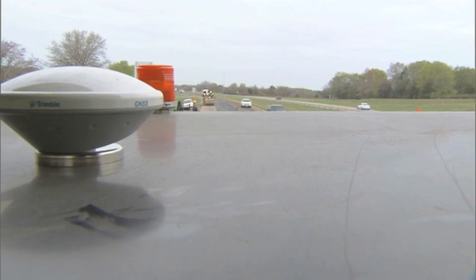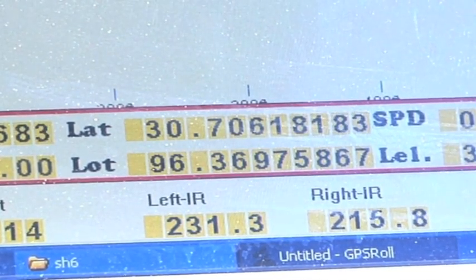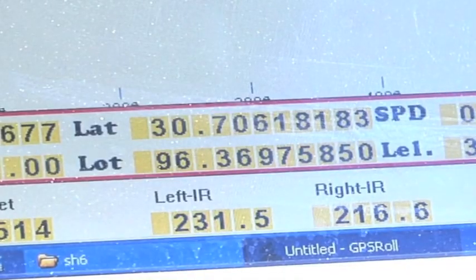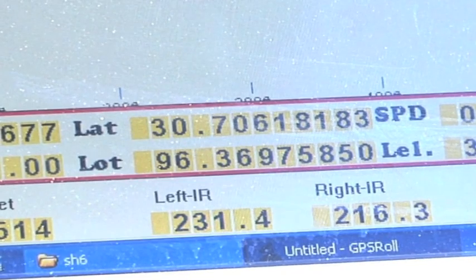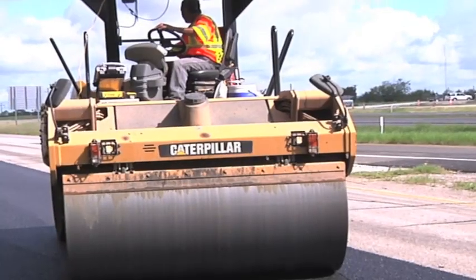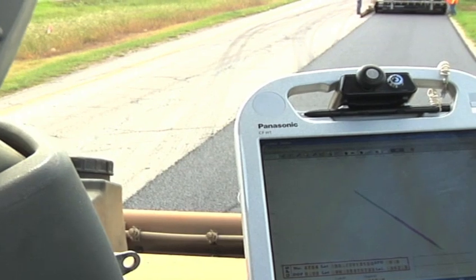They installed a GPS unit on a roller. This would have real-time data that would show the roller's GPS coordinates as it is on the mat. It also had temperature sensors on it so they could tell the temperature of the mat. The roller operator would then know, based on experience, when the mat was cool enough to get on and start doing rolling patterns. It would also track his rolling pattern so he knew how often he rolled over the same area of hot mix. If they needed four or five passes over a stretch of hot mix, it would show via his monitor installed on the roller.